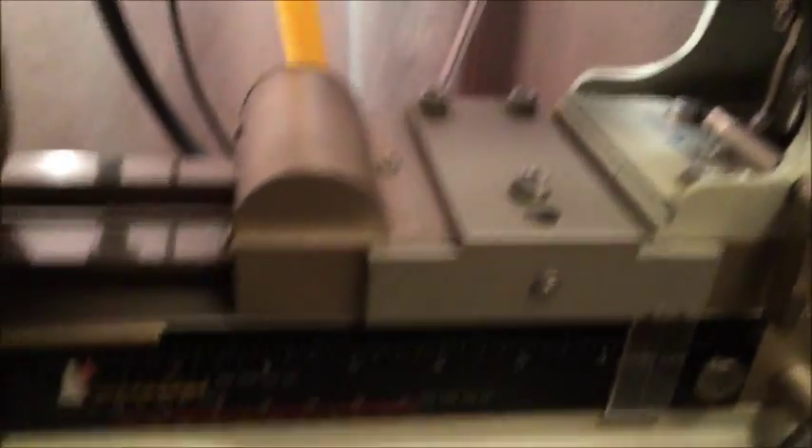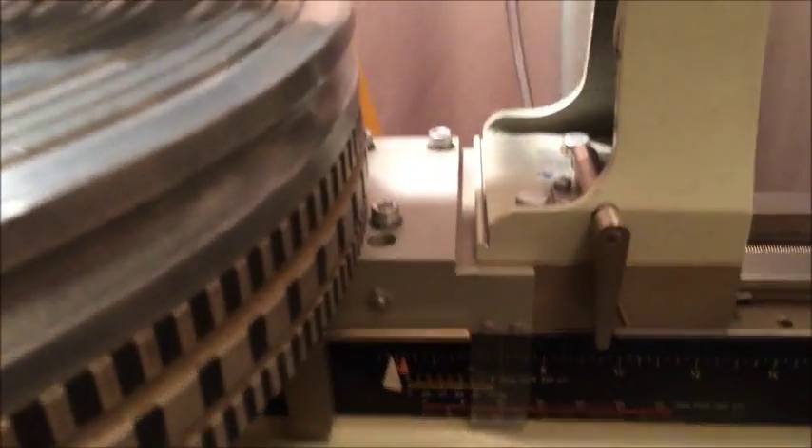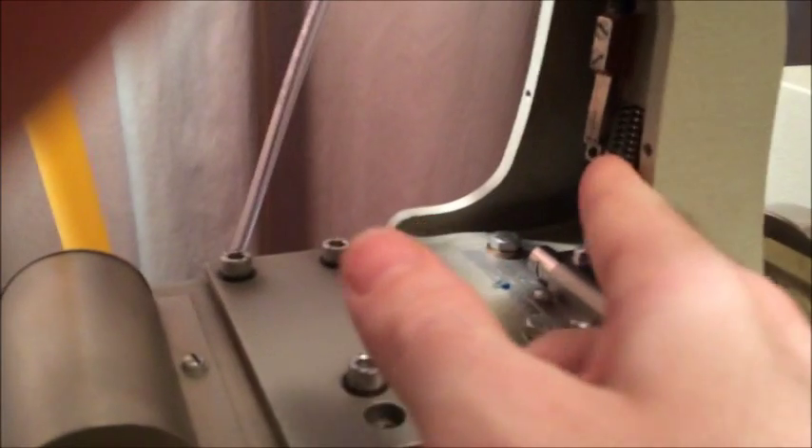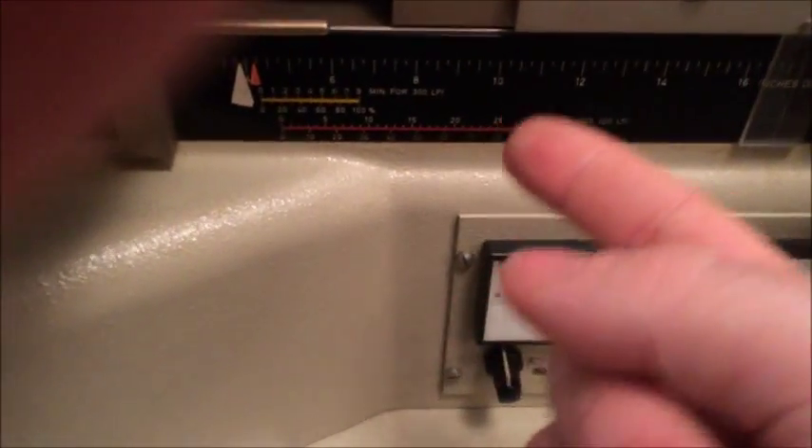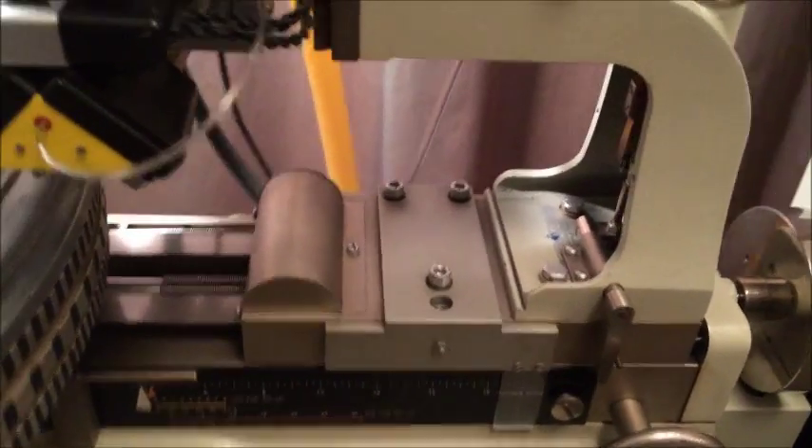If you see inside here, there's the reed switch. What it does is it's a two-position switch. Right now, because there are contacts that are normally closed, that is what will allow you to have your lead-in groove. I just put this to about the seven-inch position because I have my box set to seven inch, and you can see I'm getting a time marker. If that reed switch gets a little bent out of shape, what's normally closed will actually be open.